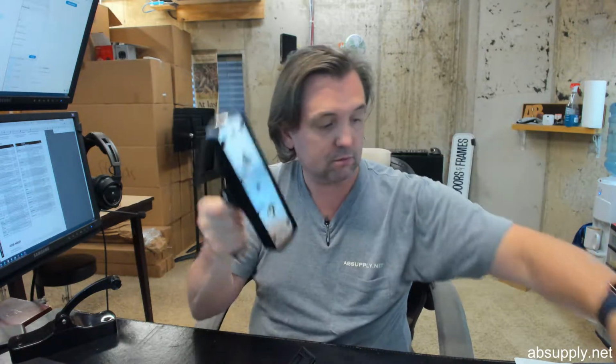Basically, they're on page 1, they're giving you a 40.5-inch center line from the floor to the center line of the device, and that's really accurate with what you can expect a device center line to be. You're going to be within that dimension, say 1/2 of an inch. So by all means, use 40.5 for your dimension. The balance of the information on page 1 basically is telling you whatever the center line is of, if there is a 2 1/8-inch hole, make that the same center line as your strike. And what that means is this is in the center of the head case. At least it should be.